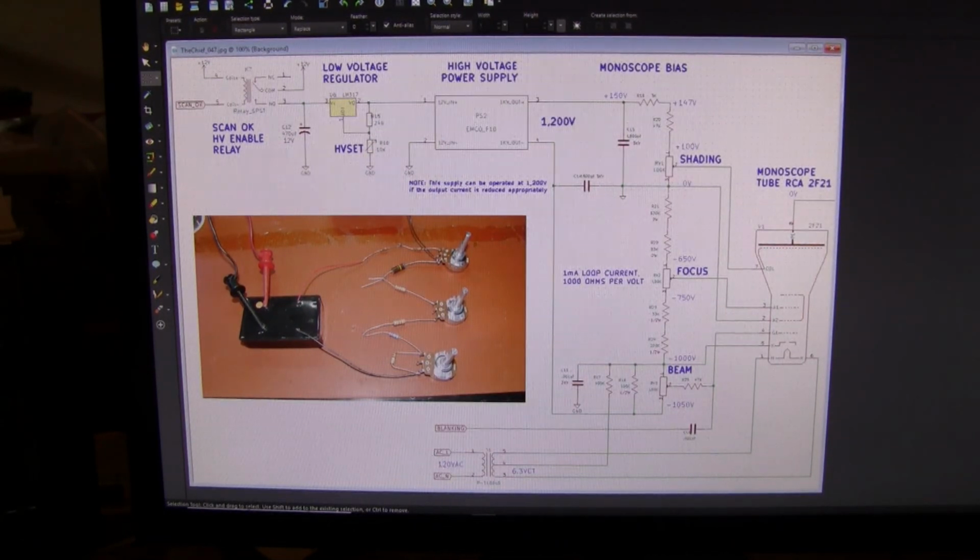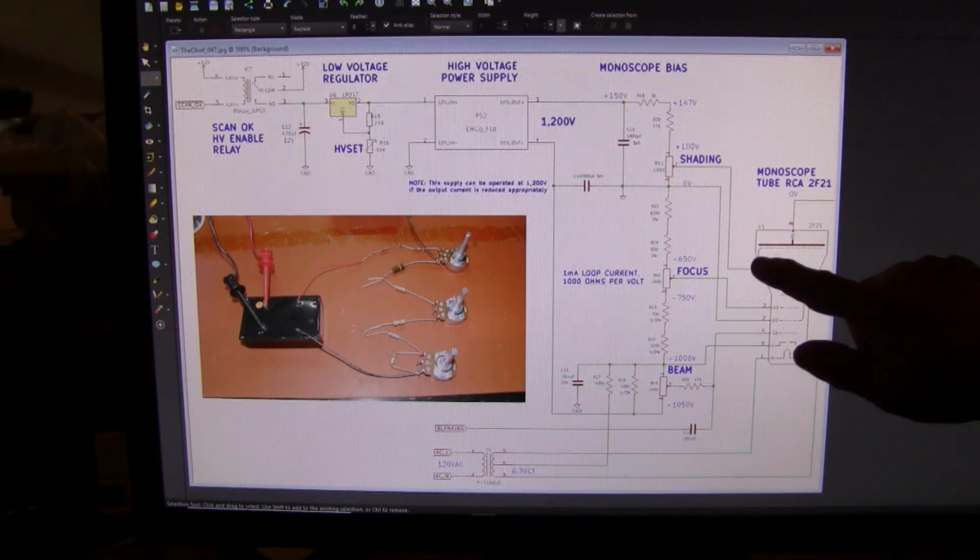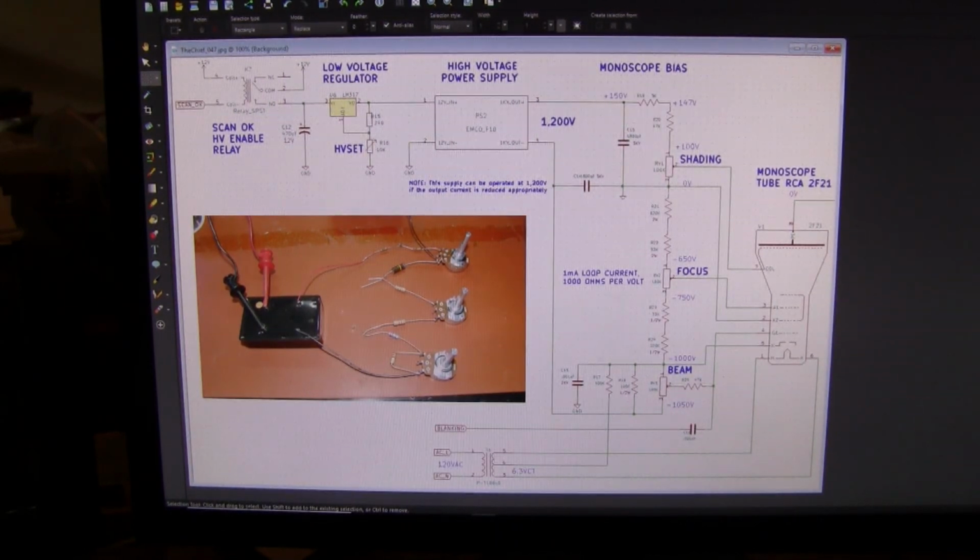The device is actually digital. The image is screen printed, and the bit of grayscale that exists in it is actually very fine screen printed regions which are printed at various densities to produce different grayscales after the output signal is low pass filtered. We'll get into that later in the video amp chain. So back to this device.